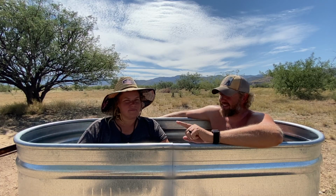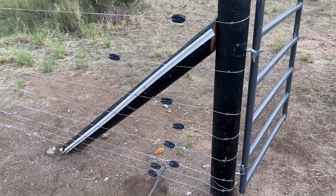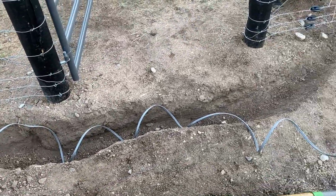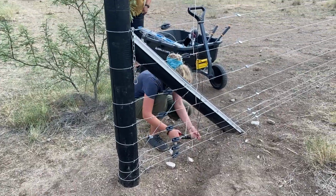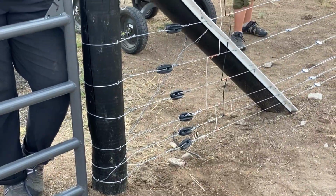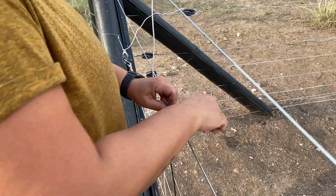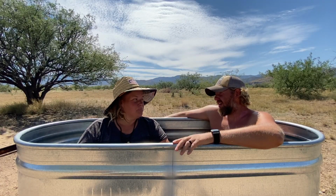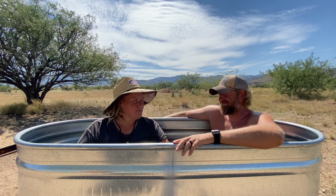Then we also had gates. So what do we do on the gates? What you want to do is you jump off of two of the lines, the hot and the ground, and you dig a trench and you go under the gate and then you come up on the other side and connect it to another hot and ground. But then you have to jumper them all back together because you want to electrify all nine of those lines. It was a lot of wrapping again, but it was the copper wire. So it was soft, and Adeline and I actually did all of that.